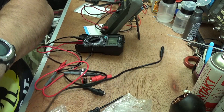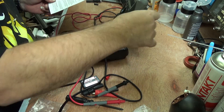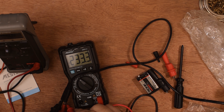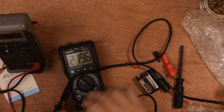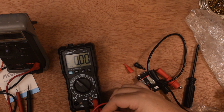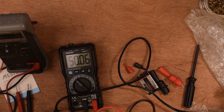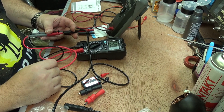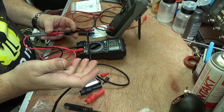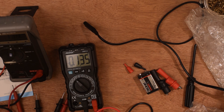Let's plug the AC line lead in again — it's live. You have to switch it manually to AC, and there we go — it's reading 233 volts AC. Taking those probes out and pressing Hertz, we are showing the 50 Hz that the UK mains is. It's accurate. It is a bit of a pain that it doesn't auto-select between AC and DC — at least with meters like the Fluke it's either AC or DC directly. But okay, I can live with that.